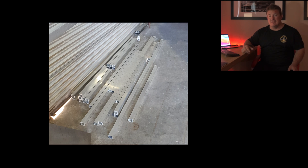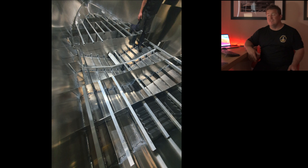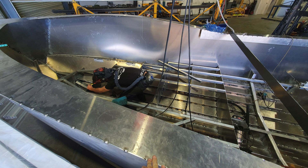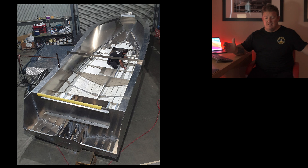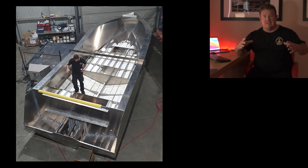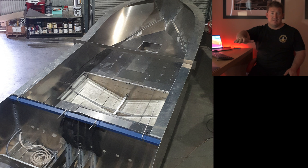All the RHS cut there — that's all the floor pieces. You can see the floor starting to go in. We've welded all that RHS in, and that's what builds up what you'd call the deck. This foam was such a nightmare to cut up but there is so much foam under the floor of that deck, and it all had to be cut to specific sizes to fit in between the stringers and the frames. From there the deck sheets go on top.